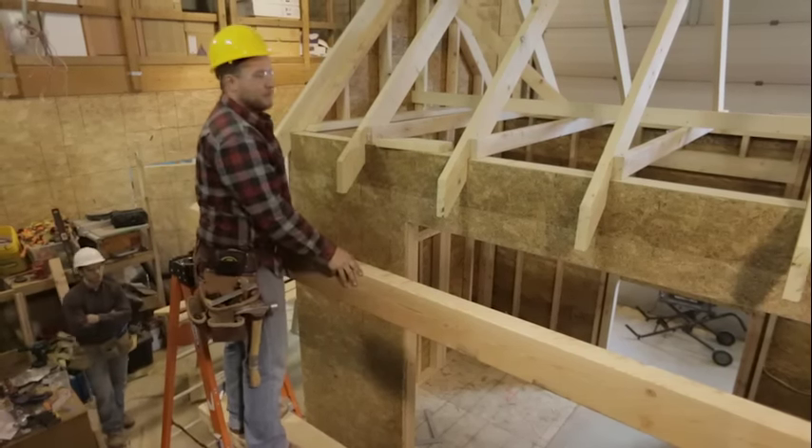Before we lift the fascia into place, it's important — just like when we were screwing down our mud sills and top plates — we want to go from one end to the other. We don't want to nail this end, nail that end, and then try to maneuver the middle to be flush. Azad can work on that end, moving the board up and down as I nail along, and it's just going to go a lot easier using that leverage. So we'll begin to put this in place.